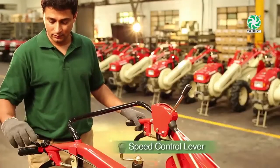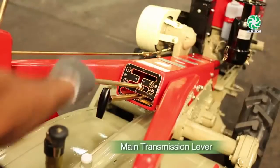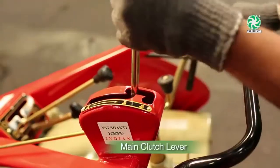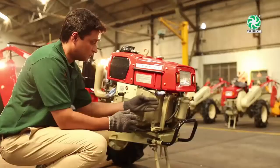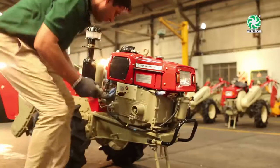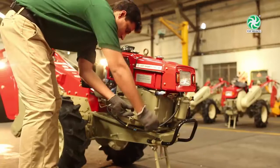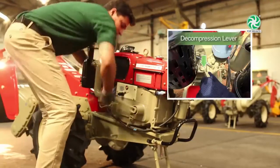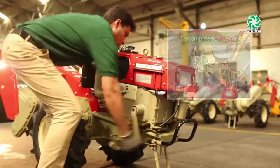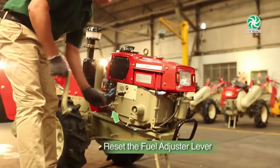Engine start system: Before starting the engine, ensure the accelerator is in full acceleration mode and check if all gears are in neutral position. To start the engine, use the starting handle fitted on the holder. Insert the starting handle into the starting shaft. Pull the decompression lever with the left hand. Rotate the starting handle clockwise four to five times — this allows lubricating oil to reach all moving parts. Once you are sure the momentum is enough to start the ignition, release the decompression lever.